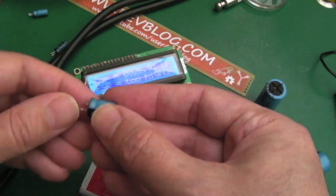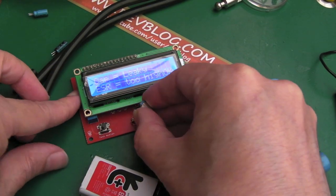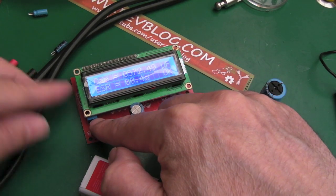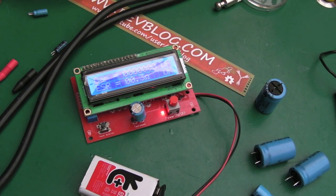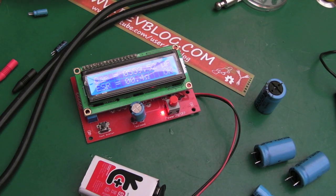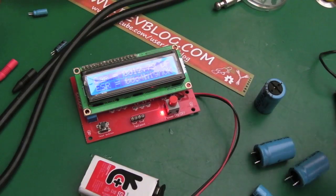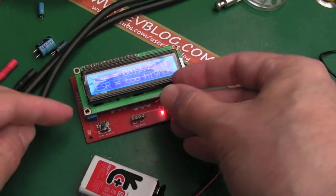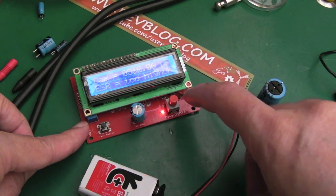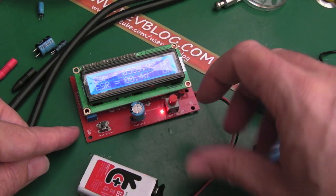Yeah, it's super hard to use this cheap tester because you've got to get the pins into the holes properly. So I think that one's a 470. Where's the test button? You could see there it came out 570 or something, with an ESR of 0.4. So that appears to be okay. The capacitances are a bit off, but that's what you kind of expect for capacitors of this era. I don't know what the tolerance was on them, maybe 10%. You see that one's similar, 540 microfarad, 0.4.